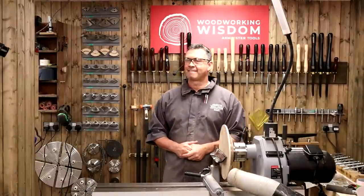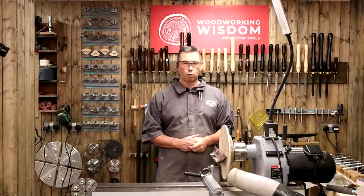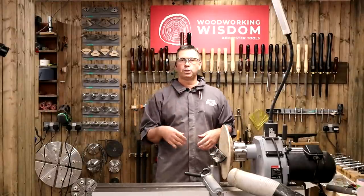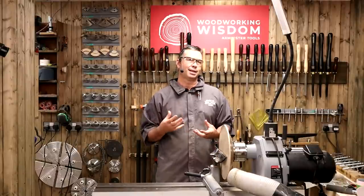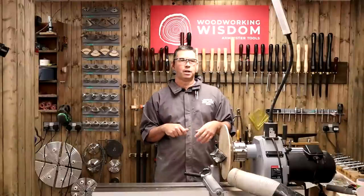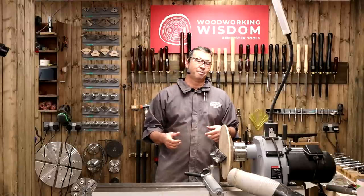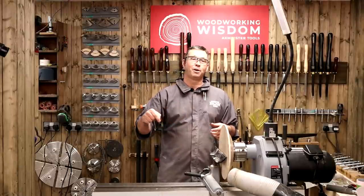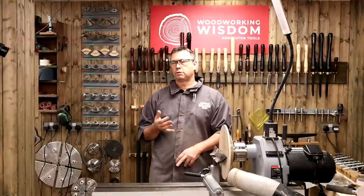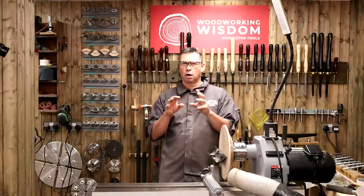Martin's asking: have you any suggestions of what woods would be best for making cheese boards? Beech is a perfect one. Oak is good but just be aware that oak, with the tannic acid in it, can react with vinegar, lemon, and all those sorts of things. I've got a kitchen table made out of oak — if I put a vinegar pot on it I'll have a black or blue ring on that table. So beech is cracking — really really good. Maple's another good one, so any of those harder timbers.